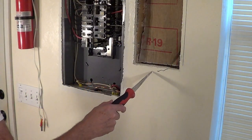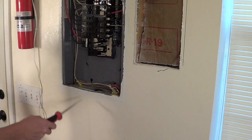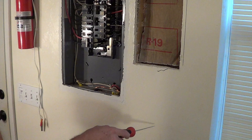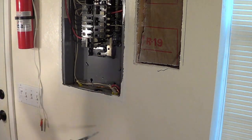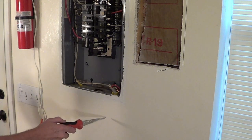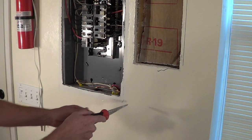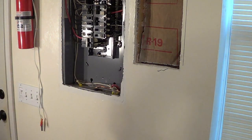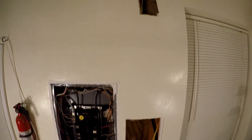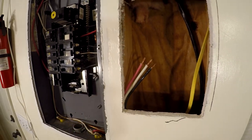The box is going to go here, and the wires are going to come down out of the box, go through a 2x4 stud, and up into this panel. I'm going to cut a hole here — I like to cut big holes because they're easy to fix — and another big hole so I can get in there and drill through the wall. I'm cutting it like a pumpkin lid so I can drop it back in and patch it up easily. I went ahead and drilled through some fire blocking and through the two top plates.